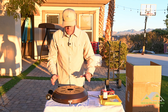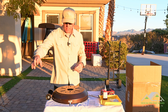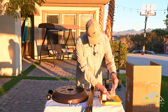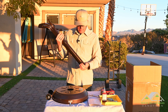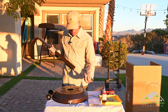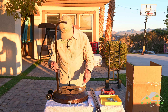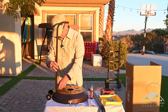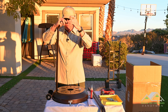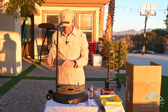Now we flip it over and put up the three arms that are going to go around the tank and hold the cover in place. These three support brackets are identical and there are pre-threaded locations for them on the base itself, so you don't have to reach underneath with a nut. I'm going to do these hand tight until I put on the pole, so if I need to adjust a little bit I'm able to do that.